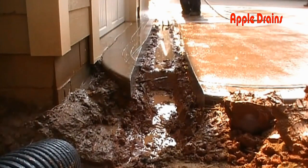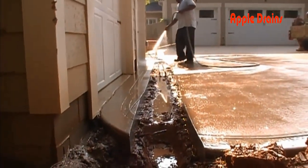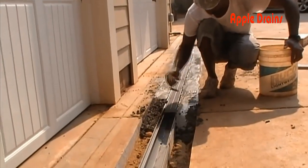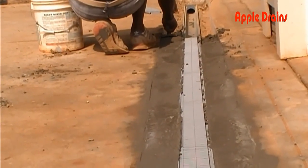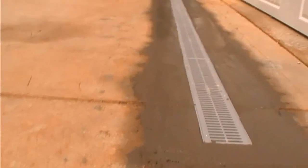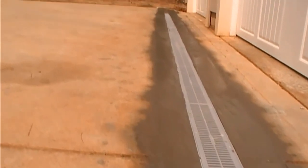In this photo you can see the discharge of the channel drain with the black corrugated pipe. This line goes back around behind the garage and it's extremely downhill, so this water will come out of the channel drain very quickly. To set your channel drain, simply add soil underneath of the channel to make sure you have a downhill run to your discharge. Then add concrete around the sides and that will hold it firmly in place. Notice our grates are upside down — we do this to keep the top of the grate clean. When you're all done, simply flip them over, wash them off, and here you see the finished product of an NDS channel drain installed.